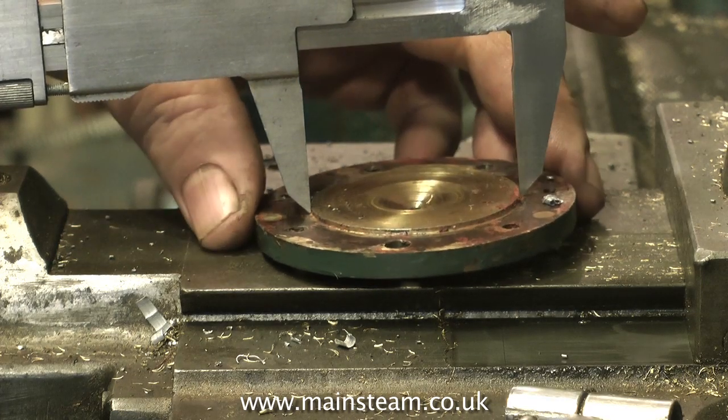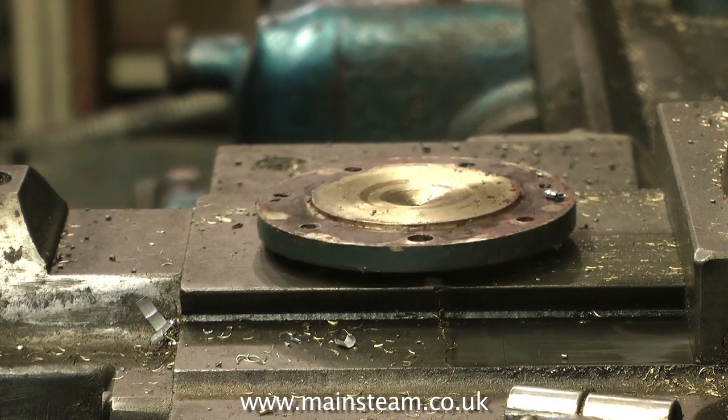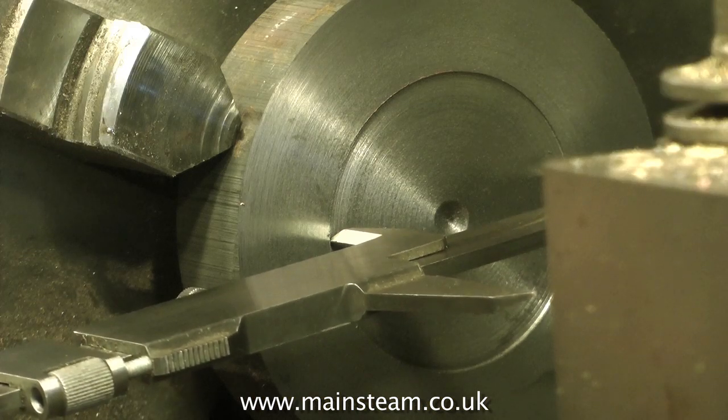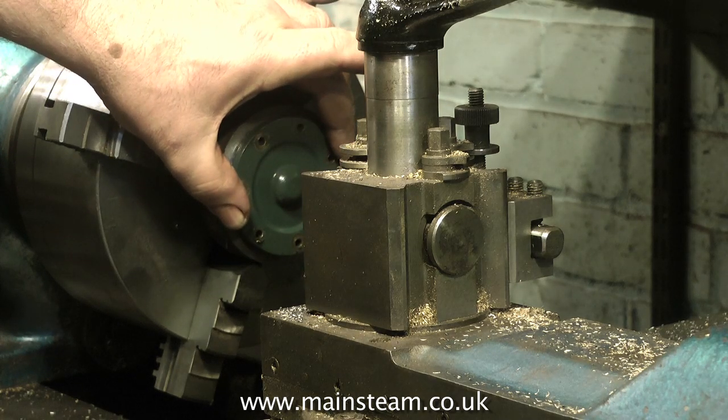This is two inches. And then I machine a two inch recess in the piece of cast iron — that way the cylinder cover will fit into the recess. And by using some Loctite 603 I can hold it in place on the cylinder cover blank, then use it as a drilling jig to drill the holes for the cylinder bolts.